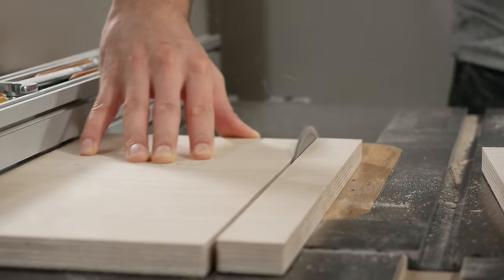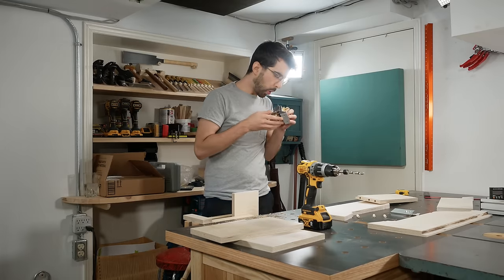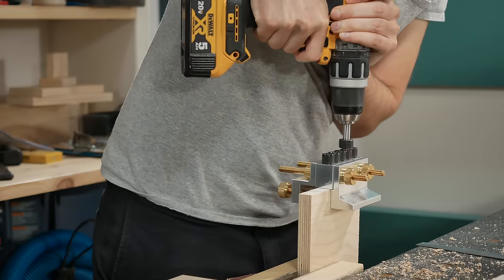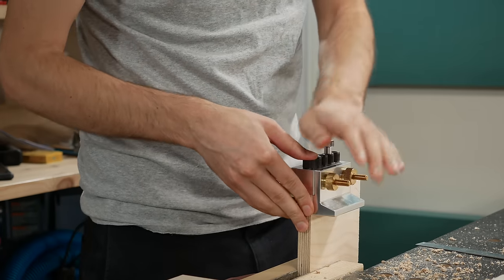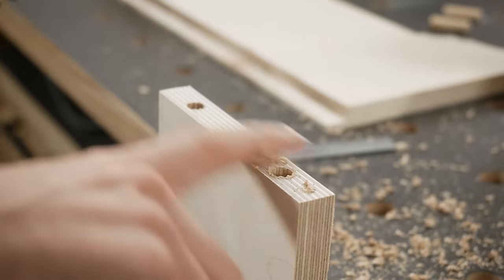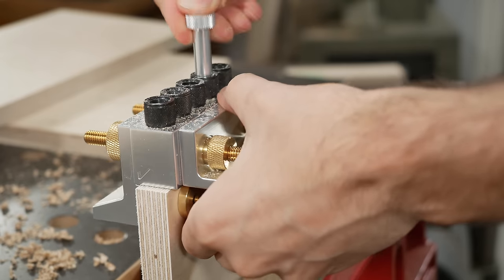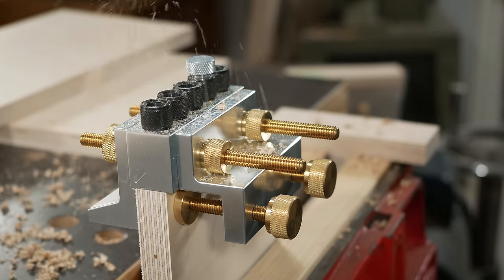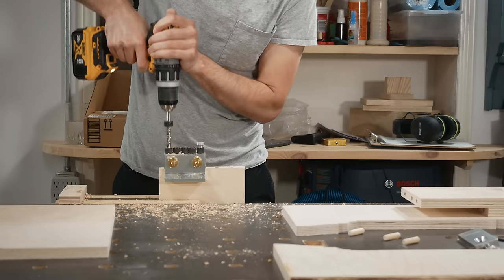Since this is essentially a simple cabinet with a few shelves, I chose to use dowels to join the shelves to the sides of the case. The dowels are a familiar and less expensive alternative to dominoes, and this jig from Dowel Max makes it super easy and foolproof. It's a bit pricey for a dowel jig, but it's just a fraction of the cost of the Domino and the strength of the joint is comparable in my opinion. I'll leave an affiliate link in the description. You could also use dados here, but they would have to be stopped dados, and stopped dados are just annoying.